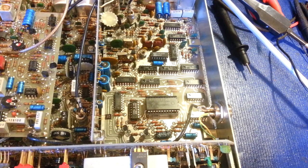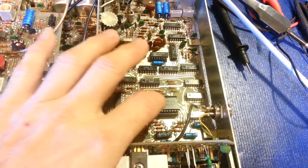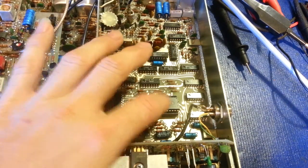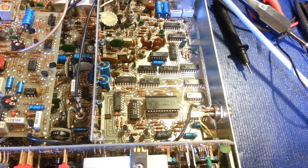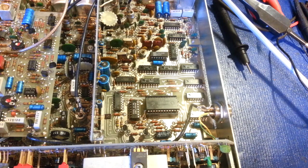It had some problems, but the problem was the negative voltage that's supposed to be supplied to the EEPROM, which is part of the power supply circuit. Some of the power supply circuit in this radio doesn't get much more straightforward and simple. But when it comes to the negative supply in these radios, holy shit, did CPI ever take the long way around to get a negative voltage. There are days I look at this — this is the first time I've ever had to deal with that circuit — and you're left sitting there scratching your head going, what in God's name was going through their heads?